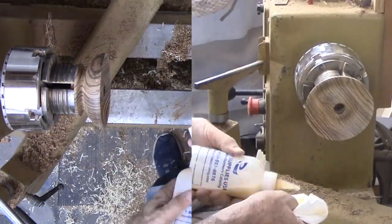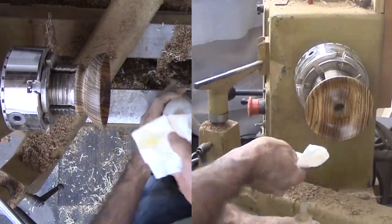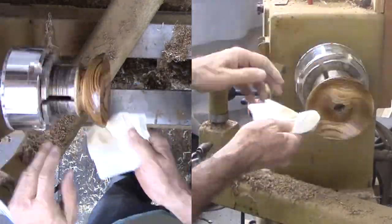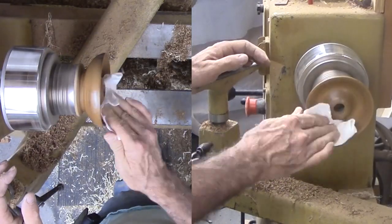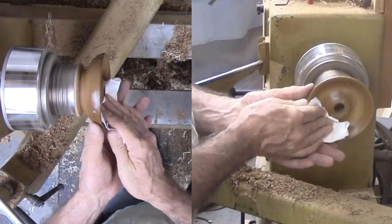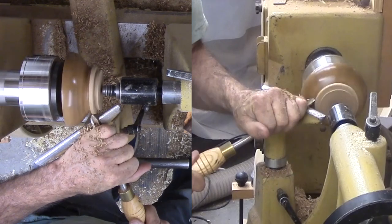After sanding, I apply shellac friction polish to the upper and outer bottom, then rub it down at high speed. No other buffing will be required. I like the shellac since when I finish the bottom, I can blend new finish into the previous finish very easily. For the bottom side, I pull out my small chuck that I use on my small lathe.